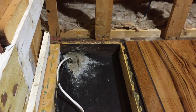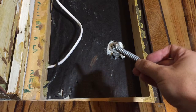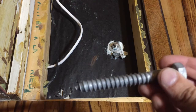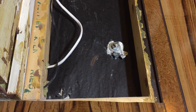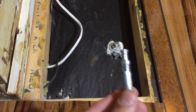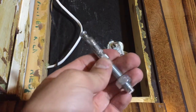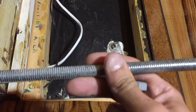For my deck, it's a lower deck, so this is where all the anchor bolts were. The alternate choice would have been expansion anchors, but I just don't like these — you've got to tighten them over time and you don't know if they're grabbing properly.